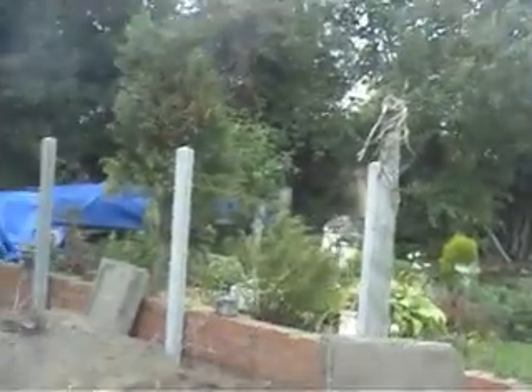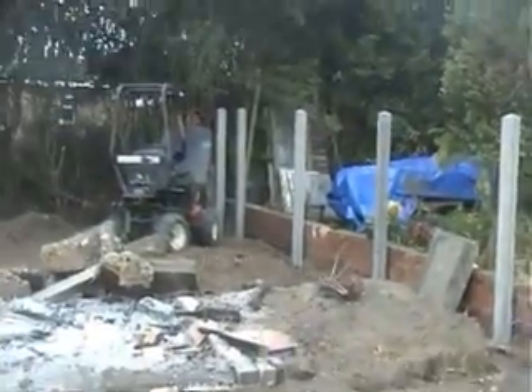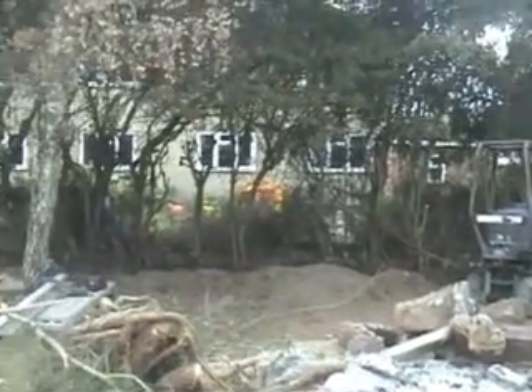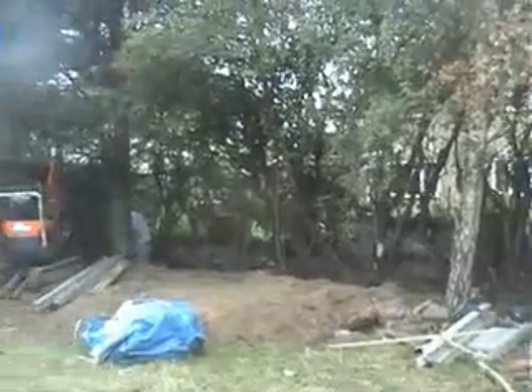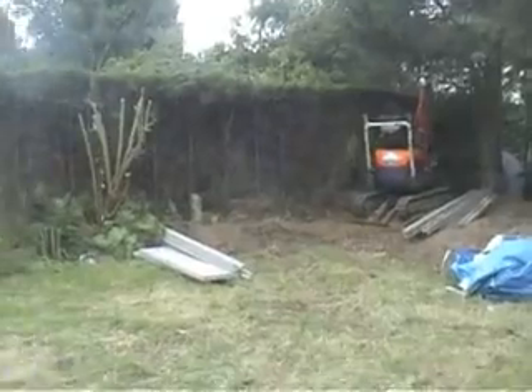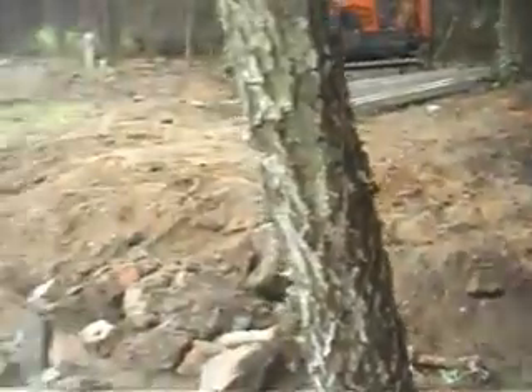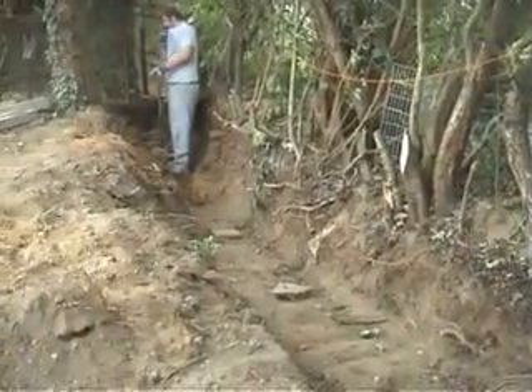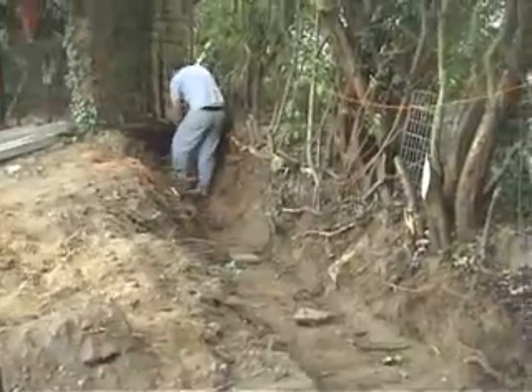They're all nice and straight and level, but they're about a foot too low. And Adrian, our customer, he doesn't want any step-ups. So by the time we get round here, we're going to have to have more gravel boards to support next door's ground — and the same over here. Even though a lot of this ground is going to be taken out, next door's ground is going to remain the same height under these trees. So we're going to have to put gravel boards to support all this soil from next door coming through at this level.